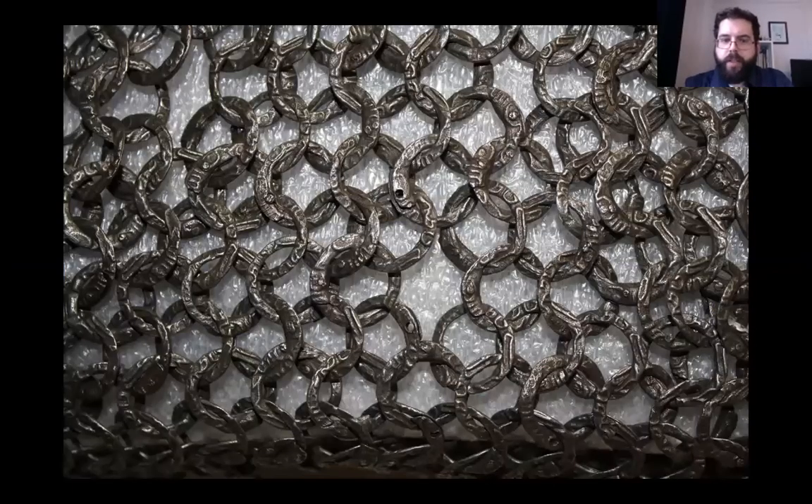When the shirt came to us, it was thickly covered in old coatings and grime. Additionally, there were bits of excelsior or sawdust lodged in between some of the overlaps, probably from old packing material. The surface of the iron rings are deeply pitted and worn. The raised areas are burnished; the recesses are dull metal without any trace of corrosion. The condition indicates the shirt was corroded heavily in the past and then been acid cleaned, the burnish caused by the rings rubbing against each other.